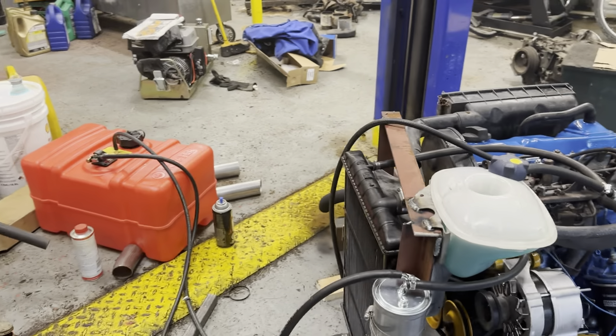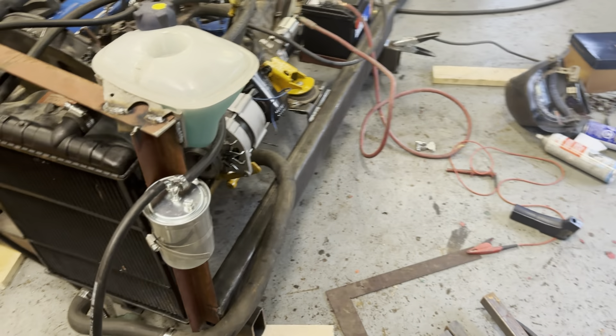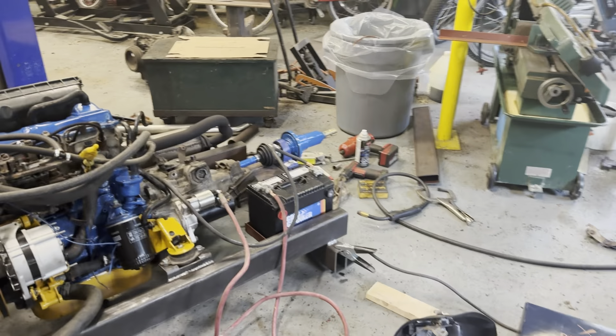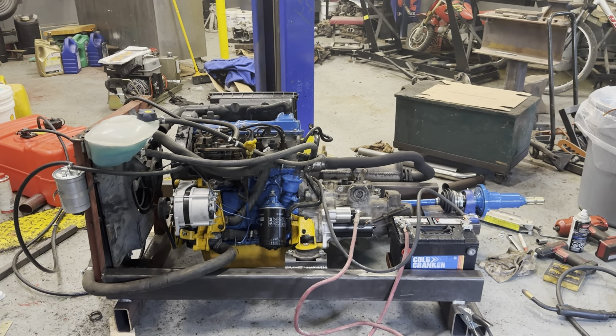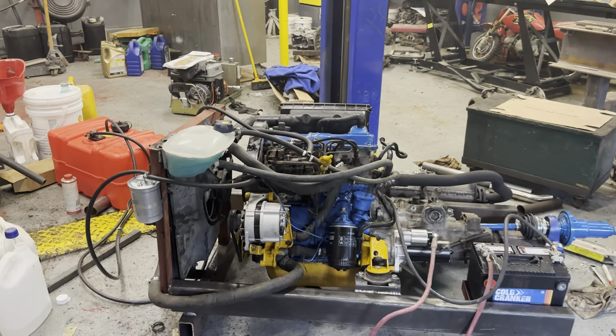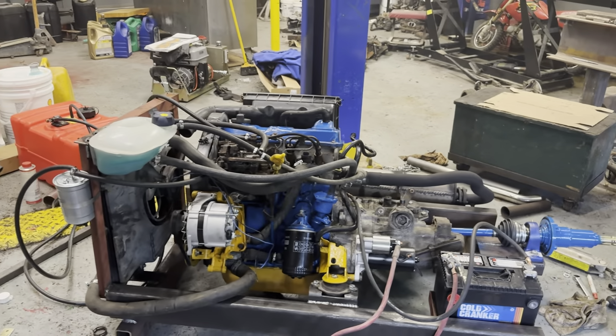It's an air-conditioned radiator for a Fox. The only thing I'm not too happy with is the way the hose goes to the front of the radiator, but it seems to cool just fine. I had it up and running and at about 85 degrees Celsius I bridged the fan to the battery and it cooled off to 77 in about 30 seconds. I'm not sure yet if I'm going to put that fan on its own switch with a sensor in the radiator — there's a really good chance I'll forget to turn it on. My wife is going to be operating this and I just want her to think about making wood, not about whether the fan is on.